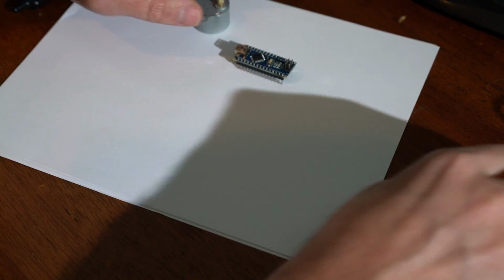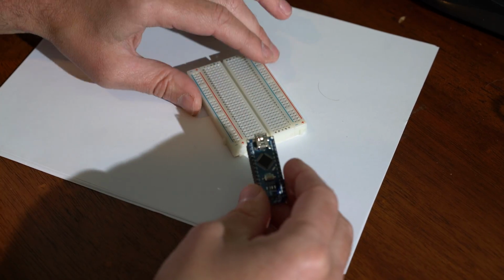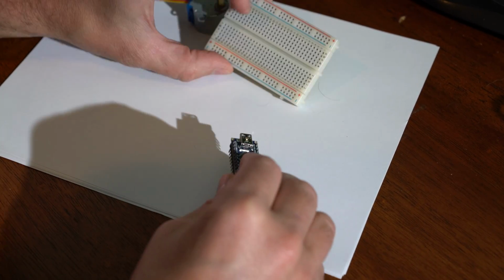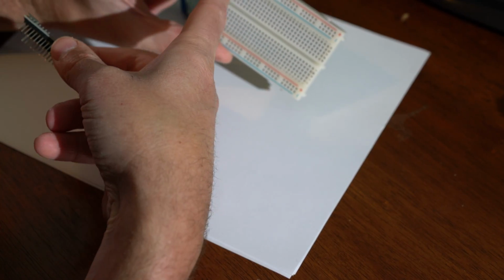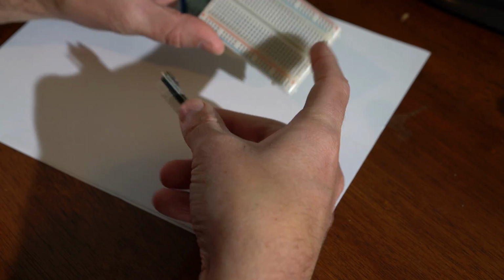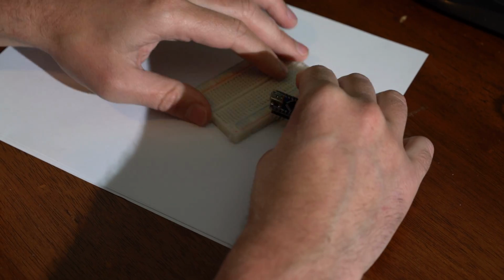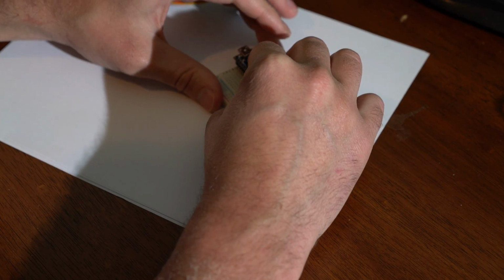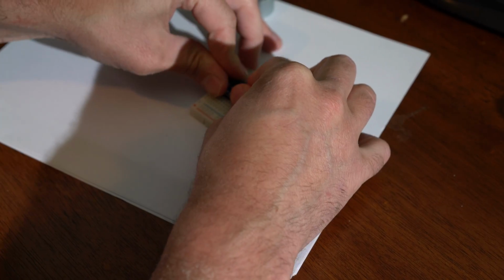So the Arduino, you can just have a breadboard, really good for development. If you just want to play with things really quickly, a breadboard's fantastic. You can plug everything in there. They basically run in parallel, so these are all the same circuits. Here you've got 30 rows that are all joined together on each side. You can plug this down the middle, and if you do it this way, the pins will match up with the numbers you're using. There you go.